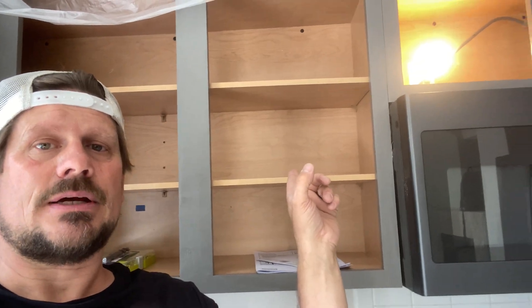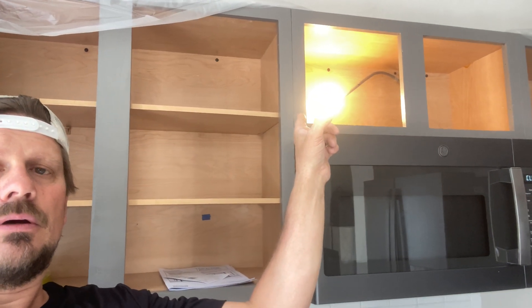If you have a two-story house with a finished basement and your panel is in the garage on the other side of the house, you've got to pipe it on the outside and then pop into the back. There's a townhome on the other side here, so we caulked around each box we cut in because of the firewall rule — you can't have air transfer through. The boxes do have air gaps at the knockouts on top, but less is better; you should probably foam it too.